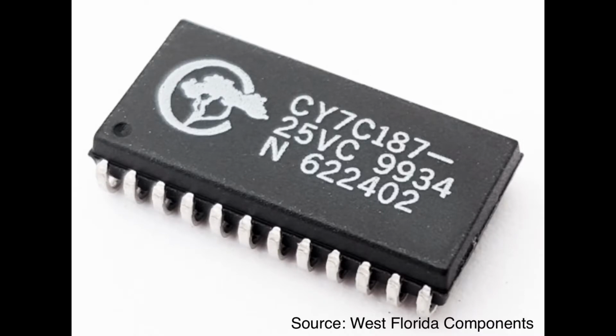Ink marking uses a rubber stamp and ink. It engraves characters, numbers, and symbols on the rubber stamp. Typically, ink color is white because mold compound is black. So, white ink is easy to read.